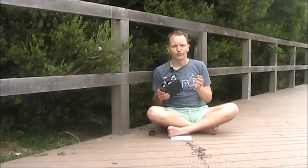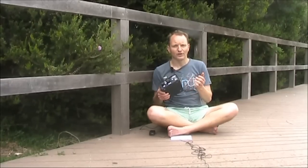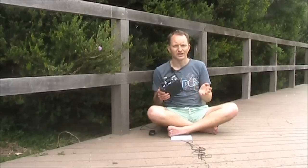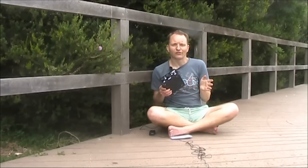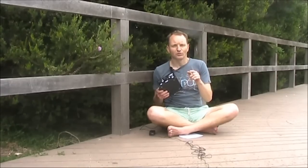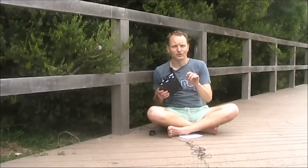There are also crystals at 4.915 MHz, which gives a difference of 7.085, also in 40 metres. This is the circuit of the original VFO in the BitX. Remove L4, which is the yellow toroid that determines the frequency of the local oscillator, and put in your 4.92 MHz ceramic resonator.